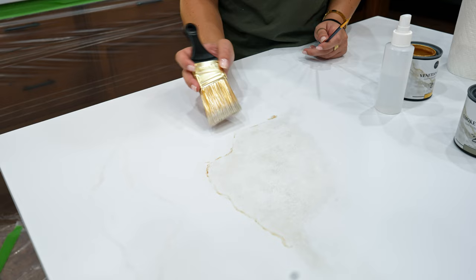To mix your first set, pour an entire can of activator into a can of resin, making sure to empty all of the contents. Next, thoroughly stir the mixture for 3 minutes and 30 seconds. You want to mix quickly, but keep from splashing any of the contents out of the container.